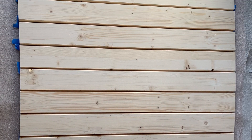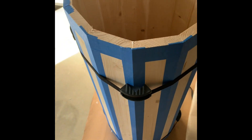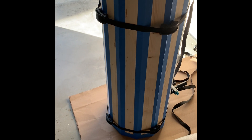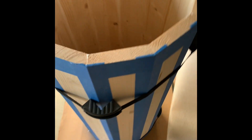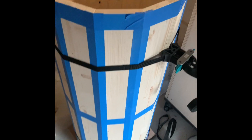Initially the core of this speaker was an 8.5 inch full range field coil driver, which I later used in an open baffle — I talked about this in my previous video. The main advantage of this driver, besides its excellent sound quality, is its ability to be tuned for different acoustic designs by adjusting the QTS. However, after a month of experimentation I replaced it with another driver, the Fostex FE208NS, as the first one was too lightweight and using it in such an acoustic design didn't fully unlock its potential — it sounds better in an open baffle.